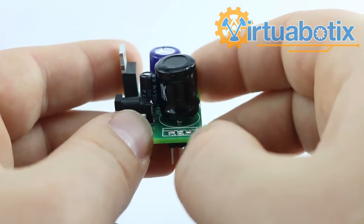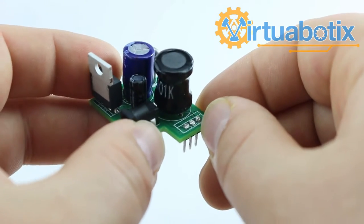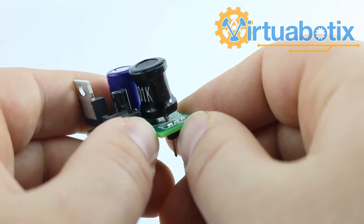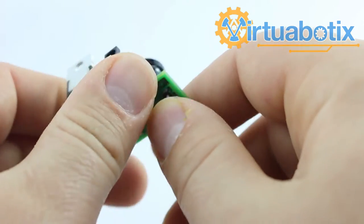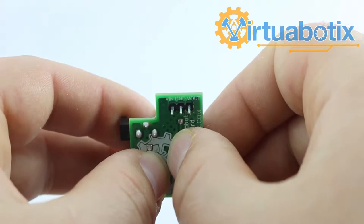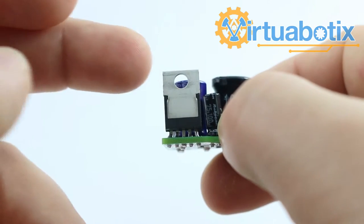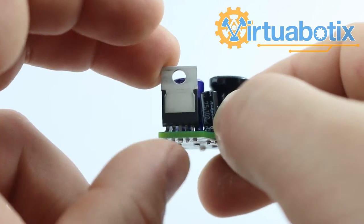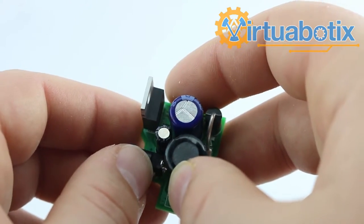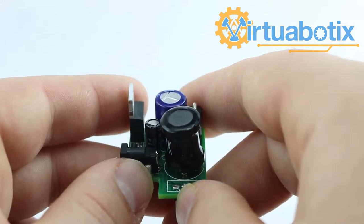It's a very stable, high efficiency circuit. On the output you have the standard TO220 regulation that you'd expect with a regular 7805 regulator for the Versalino, Verduino kit, or other 5 volt electronics. This provides 5 volts of highly efficient regulation and up to 3 amps. If you're going to use it near 3 amps, I recommend using a heatsink, as it will generate heat above 1.5 to 2 amps. At standard 1 to 1.5 amp usage, it functions well without a heatsink.